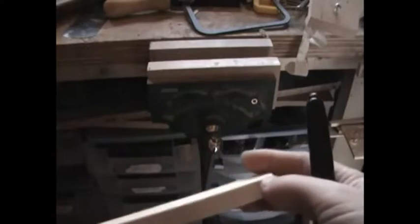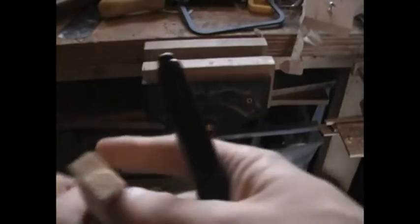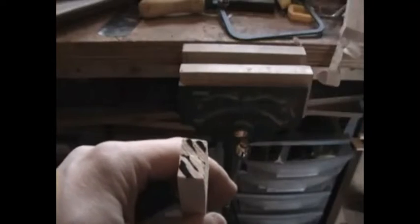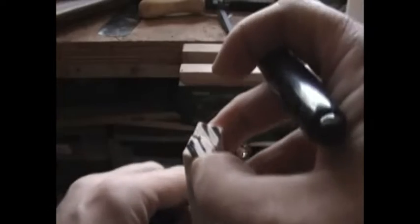Now, to make the struts on our instrument, we need to use pine or spruce. You can just use materials from a hardware shop, but you need to pay close attention to the grain. As you can see on this piece, if you look carefully, the grain is going at an angle almost like 45 degrees, like this way. This piece is only just about acceptable. The ideal you're really looking for is for the grain to be upright, so that you make the brace stiffer.